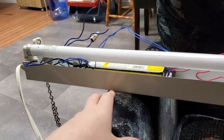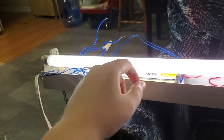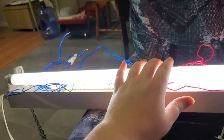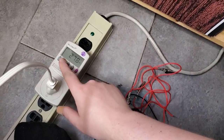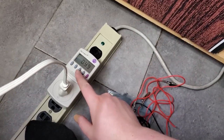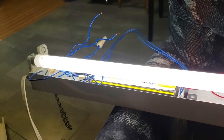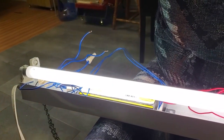Let's see that again. You can just barely see the cathodes glow. Now I'm wondering, what's our power like? 28 watts, 0.22 amps, and nearly perfect power factor. It pushes the lamp with most of its rated current.